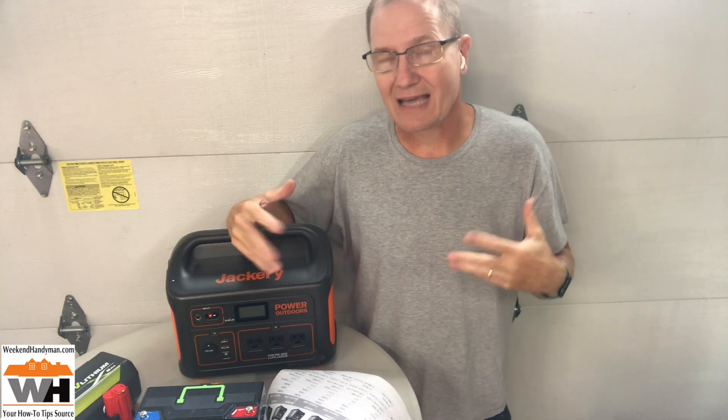So for some devices that have a little motor and need to start — like air conditioners, when the compressor has to ramp up — something like this could handle a very small AC unit. Whereas if you get into bigger things and it has to ramp up, this isn't going to be able to do it. An example would be an RV camper: when you start the air conditioner on your RV, it has to ramp up and power that compressor, and if you don't have enough wattage available to handle that it's not going to start and it's going to burn itself out. So these have the ability to handle some quick spikes above their continuous rating, which is kind of a neat thing.